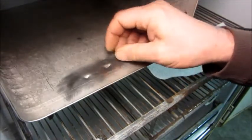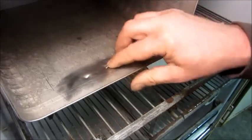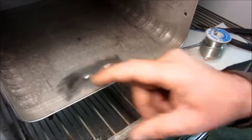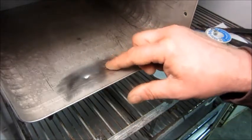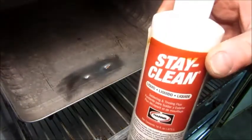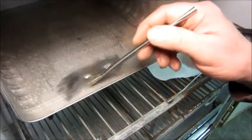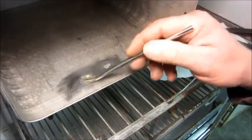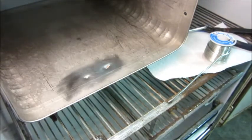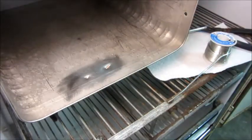To help keep the solder from just flowing through the little slot — since I can't get to the back side to tap that closed — I'm going to lay a little piece of wire in there. All that's doing is taking up space so the solder will cling to it and fill in the area around it. I'm going to use Stay-Brite 8 solder, which is 8% silver, and Stay-Clean liquid acid flux. It's very important that you use liquid acid flux when working with stainless steel — if you try to use grease-type flux it will not work. Grease flux will burn before it gets hot enough for the stainless steel to take solder. I'm taking the hoses off but leaving the service valve open so pressure can't build up inside while soldering — because if it does, it'll just push the solder right off.